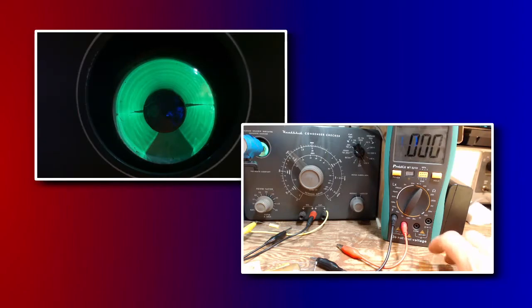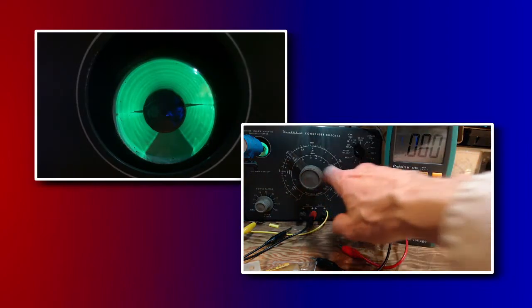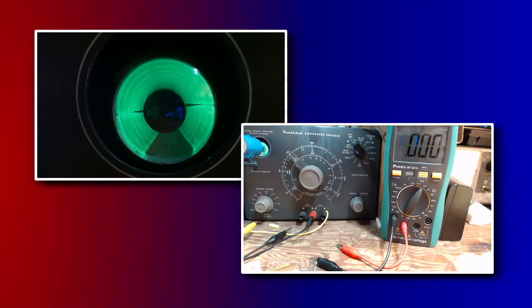So I could easily be pulling out capacitors, testing them for capacitance with this meter, seeing them all with vast amounts of capacity, even well over their original rating. Meanwhile, really, it's the leakage in the capacitor that's throwing the instrument off. I think that's the lesson here. I think that's an important lesson for doing any of these tests. So it's kind of all about how leaky these capacitors are.